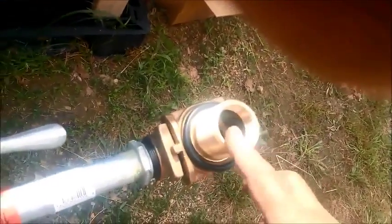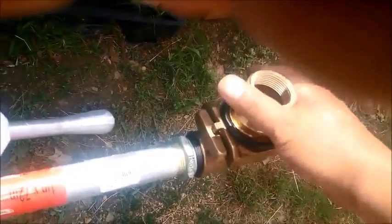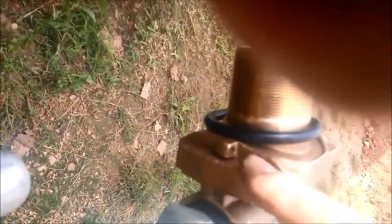You do not want to lose that o-ring when lowering into the well casing, so you have to be extremely careful. This has to be lowered vertically down, running the outlet against the inside wall of the well casing to prevent it from falling out and to provide friction. Once we get it through the hole, all we're doing is pulling the T-post up. They do have a safety ring where you can attach wire or string, but there's enough friction in the device to hold it stable if kept against the well casing.